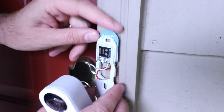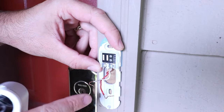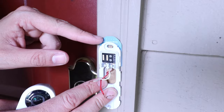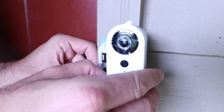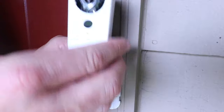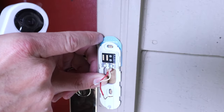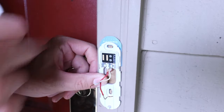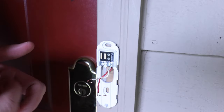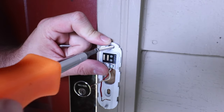To install it vertically, I'm going to put the wires through here and then put my two screws in. There's a little cardboard piece included for extra clearance to slide the doorbell on — it slides down onto the base plate, so you can't have anything directly above where that blue tab is. Let's go ahead, put our two screws in, and take out the clearance tab. We take our wires, put them through the center of the plate, get the doorbell aligned, insert the first screw and screw it in.